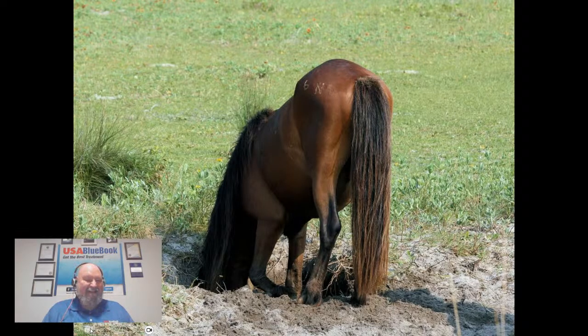And John, just as a disembodied voice from the background here, I'm here in Tennessee. We still have a lot of residential properties out here that are on old dug wells. The challenge with dug wells is they take shallow water and surface water, and you tend to have a high risk for coliform, especially when they're somewhere near a septic system.